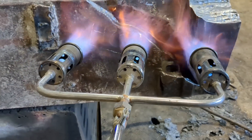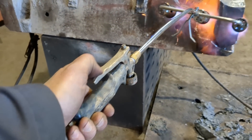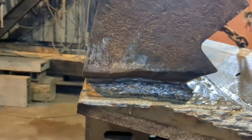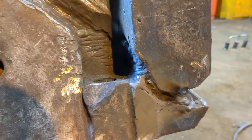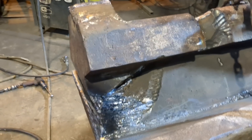So we have a good few hours welding this. When it's finished welding, a few of the machine faces have to be built up. When they're built up with weld, the milling machine can mill all of the faces back to the original size they used to be before it twisted, bent, and got worn — and also correct any misalignment from welding. Here you can see partway through welding we have a good base in the root runs inside that large V prep. Really tricky shape with non-uniform widths, varying angles, and different angles for access — just the way I like them.